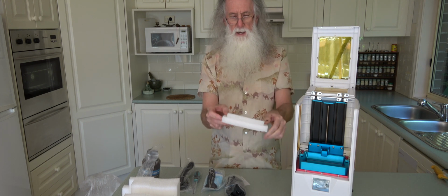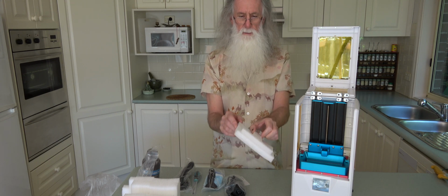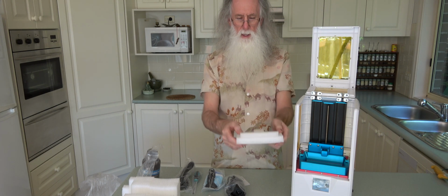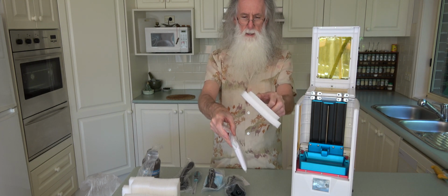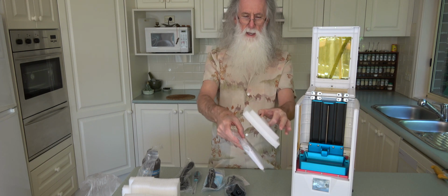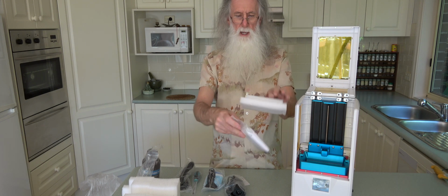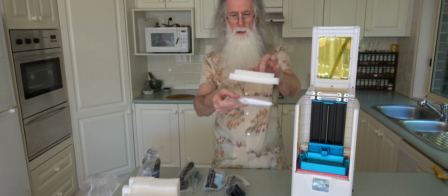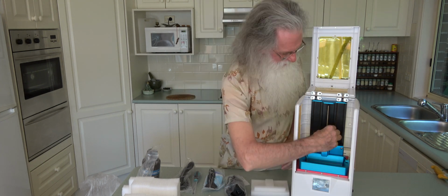And then another photo gets flashed, that bit of resin gets hardened, and it moves up and moves up. So if this has got your 1 mil slop and 5 mil like that, as it moves up, it can wobble like that, which means the model that was down here is now sitting over there. And that corner that was 1 thickness away, maybe less than 1 thickness, and this other side may be more than 1 thickness. So the idea is that the more rigid it is, the more parallel it is, the more accurate your print should be. But that's the theory. It just depends on the quality.